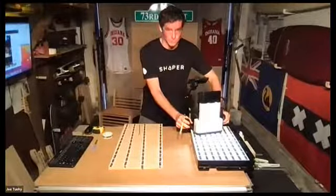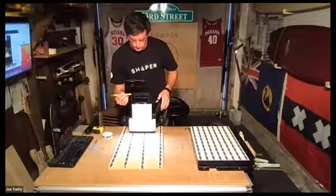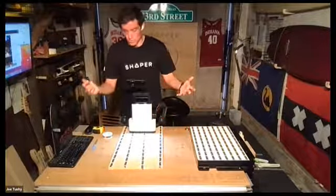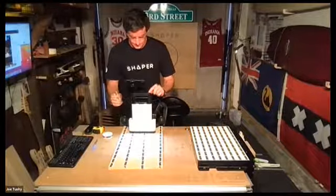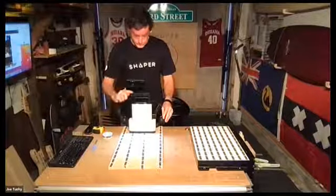It's not the answer to everything, but it is incredibly accurate — you really want to be working on more or less flat surfaces. At any point you can go back through the steps. If you realize you didn't add a reference mark, you can go back to scan, select 'add to scan,' and that will stitch any new additions or new tape to the original workspace.